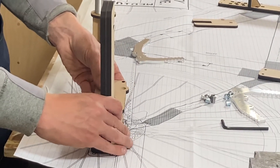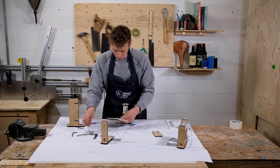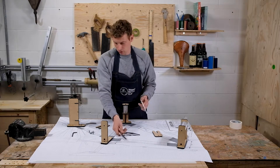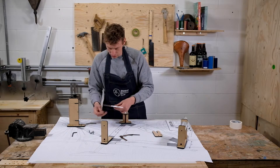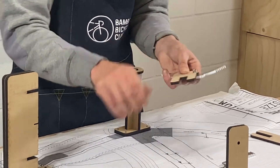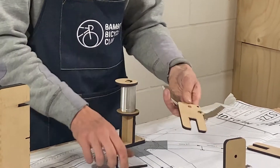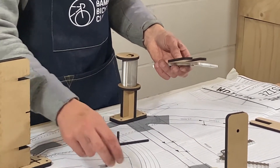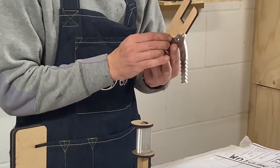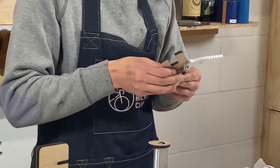It's a little bit easier if you fit the dropouts first. This is our drive side and this is our non-drive side — it's got the disc mounts, so that's the big difference. This fits underneath here like so, then we take our fixings and lock it in place. With our modular dropouts, once you've built the frame you can fit all the different attachments. We've got two points of fixing, which allows for a lot more precise alignment. Our old jig only had one, and we found you do sometimes have issues with frame alignment. By having two points of fixing, you end up with a much more precise build and the margins for error are a lot lower.